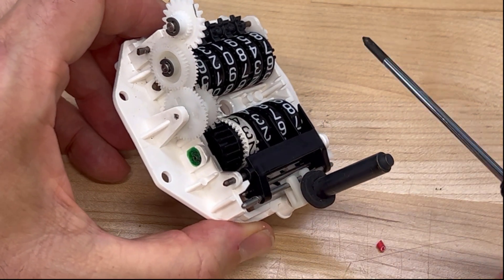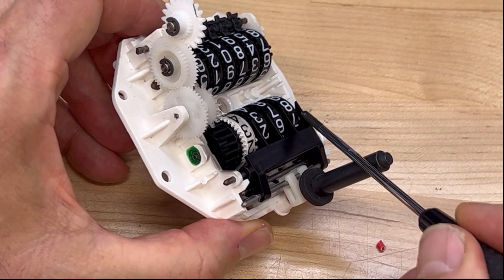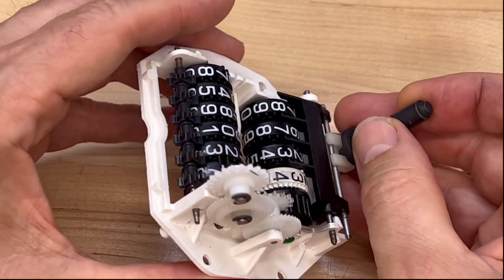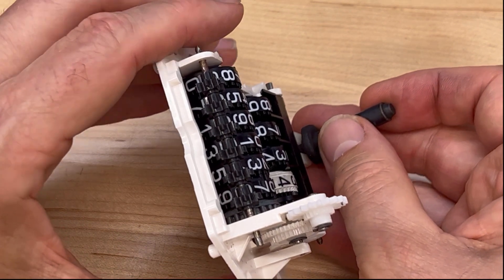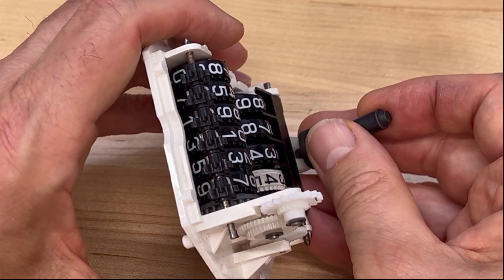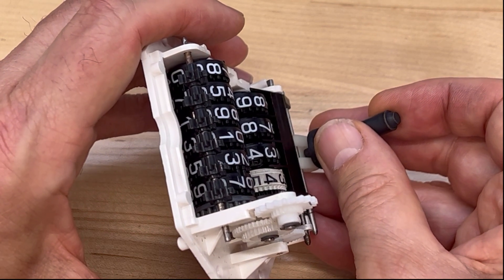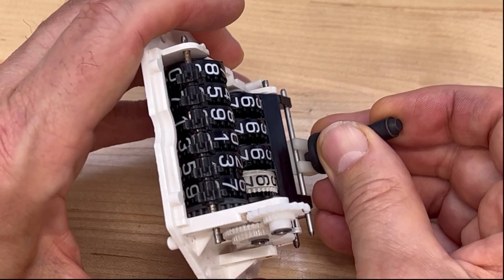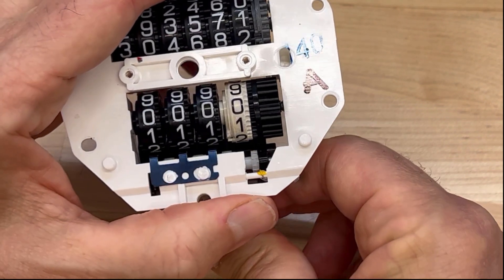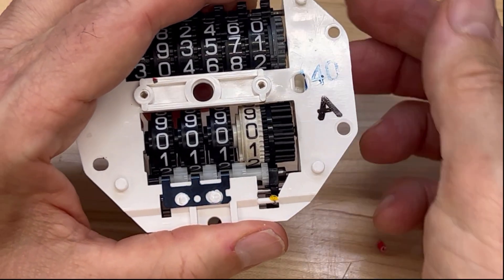You can see there are these little arms that slide — that one in particular you can see — and they slide down in between the gears. See them right there. So when the solenoid pulls on this mechanism, those little arms — you can see them starting to go down now — push on those eccentrics. And when they push all the way down, it forces the gears to zero in front.